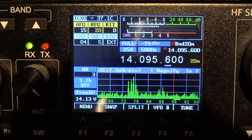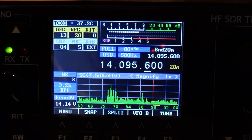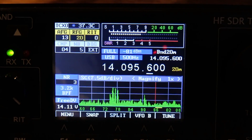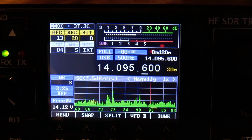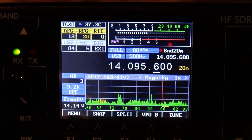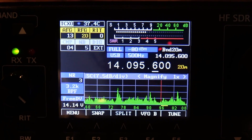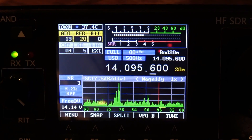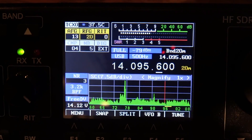I'm receiving right now and you probably don't hear much, but signals are there — they might be below the noise floor level, and that's fine. WSPR is able to pick out signals, much like FT8, below the noise floor level, so the computer is hearing it even though I can't hear it.